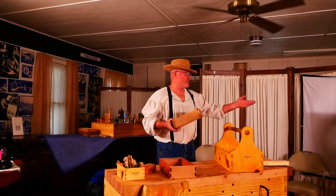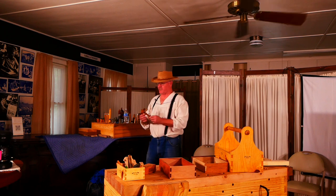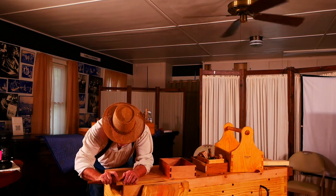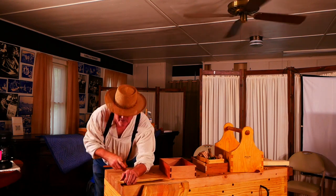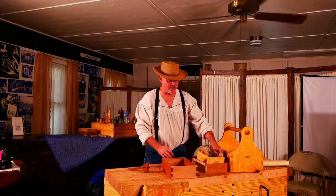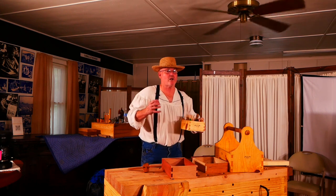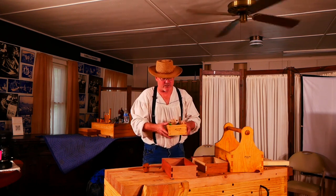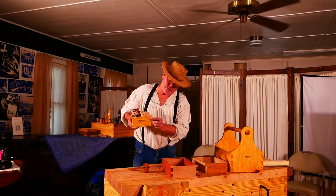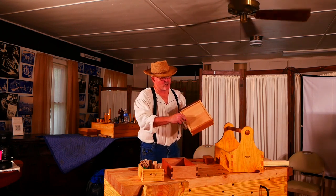This box is made exactly as they would have made boxes in the 1700s — hand-cut dovetails. The lines you see are from the marking gauge. On machine-cut dovetails the joints are uniform with no mistakes, because they were done with a router on a jig. The scoring line on the box bottom — a groove that goes in for the drawer to slide — helps identify old work. You can look at a drawer and identify by saw marks and hewn surfaces whether it's old.